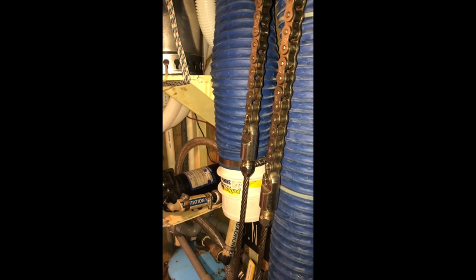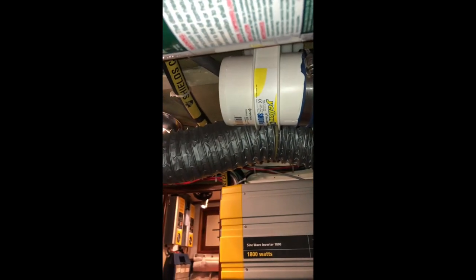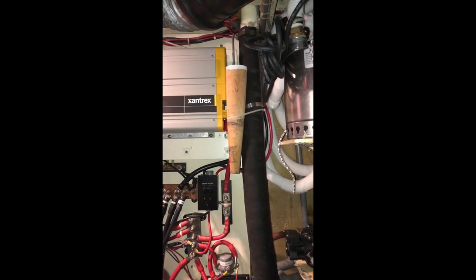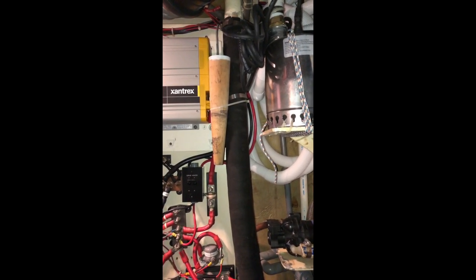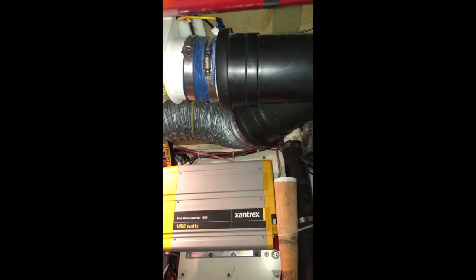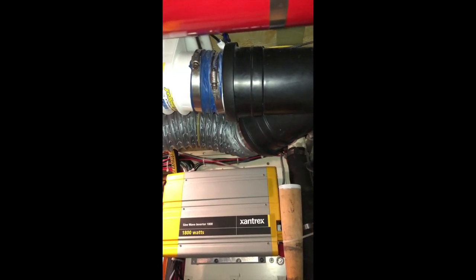These are blowers — we've got the engine room positively ventilated. You can see one of the vent blowers there; that's blowing in, and up on the engine room roof there's one that's sucking. We've got them balanced out — they go out through Dorades so they're safe from flooding. Allowing for the amount of air the engine itself is using, the room is just a little negative pressure, so you're not blowing a lot of heat into the boat. You don't want the engine room to be positive pressure because you end up blowing heat and fumes into the boat. There's also a blower over the stove in the galley as an extractor — really nice to have, because one of the byproducts of burning propane is water vapor, and that's a big reason why a lot of yachts are so damp.